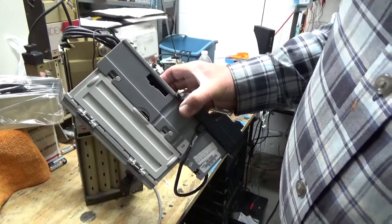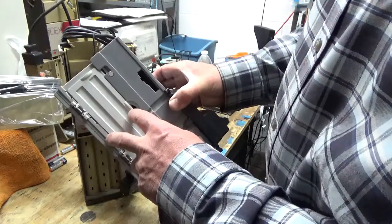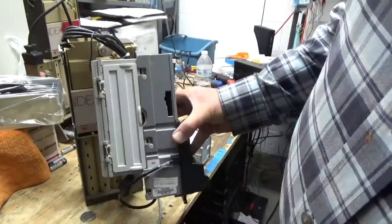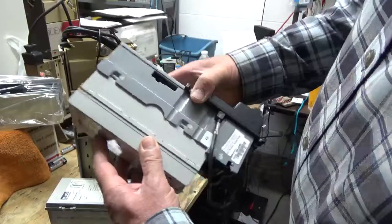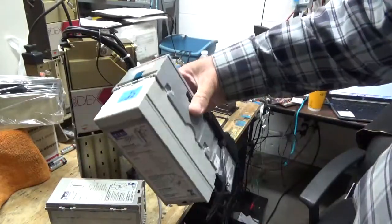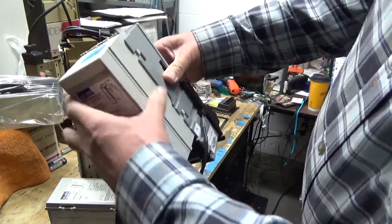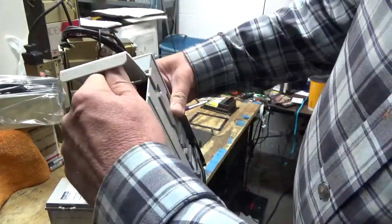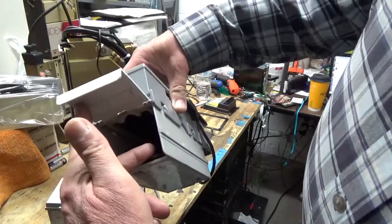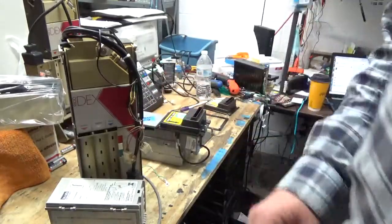While we're on this topic — some single-price machines: this box is a 300-note box. To fill that up you'd need a 440 Dixie Narco and it would almost have to go empty. The problem is some doors don't shut on the older machines — they don't have clearance. So we always have in stock the smaller boxes. This is a 200-note box, which is convenient because sometimes you have a hard time getting the box out since it has to go up first and there may not be clearance. But it has a flap door — all you do is pull back the stacker and pull the bills out.